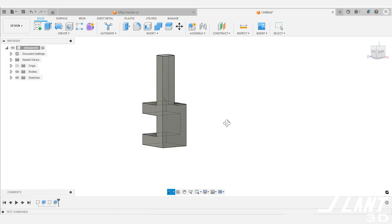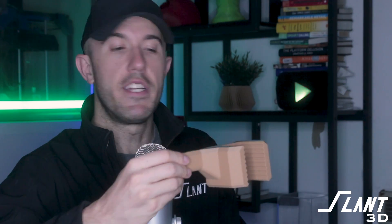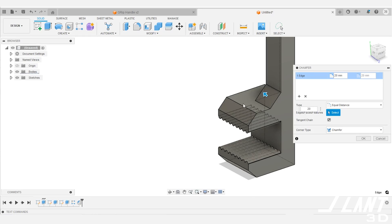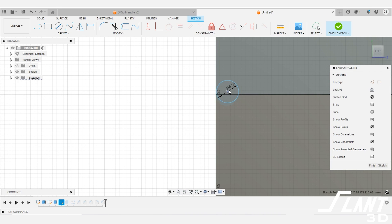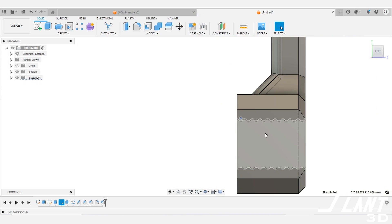Let's look at this one. It gives a nice context of the texture, color, and feel, and has interesting teeth on the inside that add extra grip. This is an off-center type of lifting handle — you put it on some beam or board, grab it, and you have friction so you can lift it up. These are really handy for movers and have to be really durable. To make sure it's durable, there are no stress concentrations — we use chamfers in here. Straight ones are chamfers, round ones are fillets; the chamfers look really good and match the overall aesthetic. The handle is printed flat on the bed so there are no weird overhangs. The center teeth are actually less than a semi-circle — they're pushed in slightly so that there's no instant horizontal start to the curve, which is really important to prevent those teeth from sagging during printing.